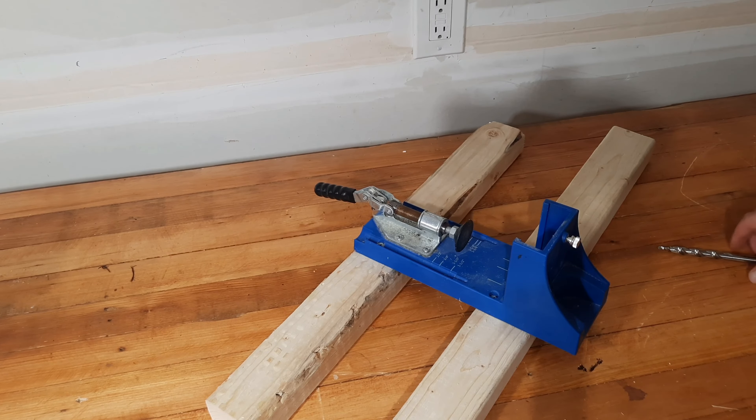So this is what you end up with — you get an oval hole, and then you'll actually have a little hole right down there, which is where the tip of the drill goes through. That's why it's important to set it up correctly, because you don't want that step too low. The corresponding screw for this thickness of wood may end up going too far through and poking out the other side, which is just not good. So make sure you don't drill too far down and have everything set up correctly.